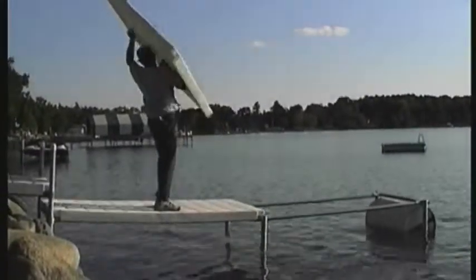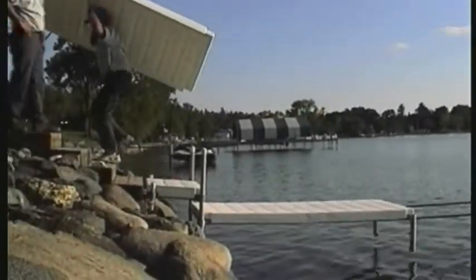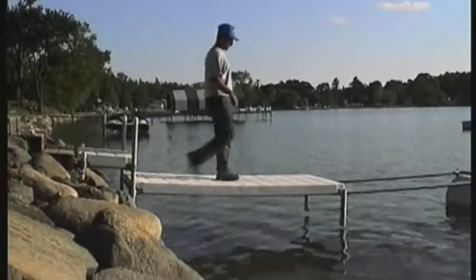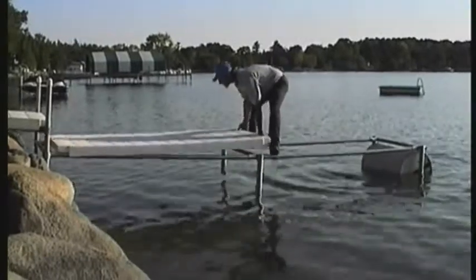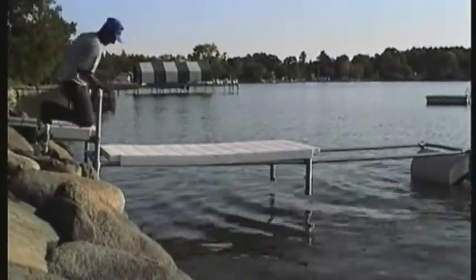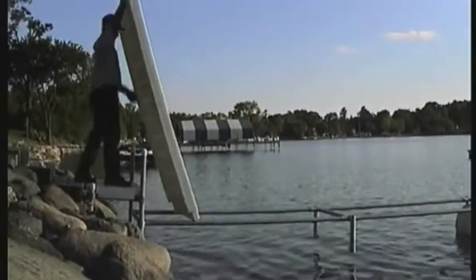One person carrying the decks at another angle. When removing the starting deck, if there is a situation where steps are resting on the deck, you will need to walk out onto the frame that is without a deck to pull the first deck out from under the steps. The underside of the deck is designated with 11 inverted slots. These slots provide many options for lifting the deck.